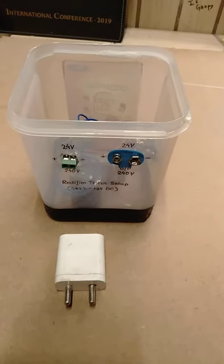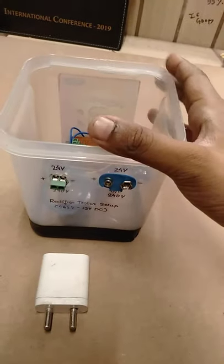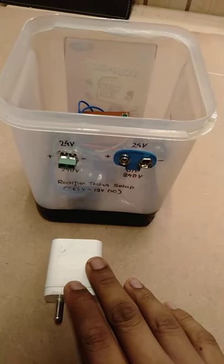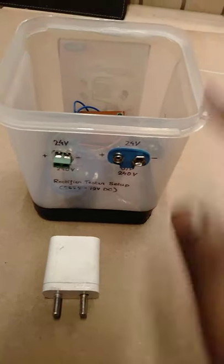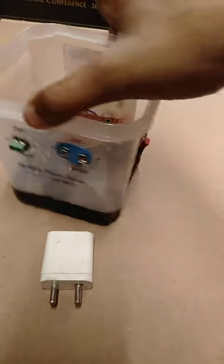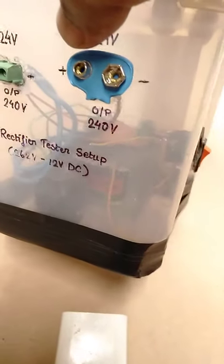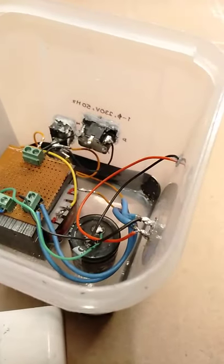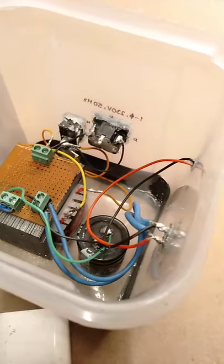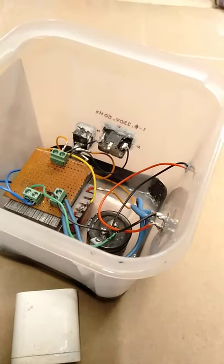There are also frequency considerations and the efficiency model of the system. Although both are power equipment, the SMPS is more efficient than the rectifier. The biggest problem hitting the rectifier's efficiency is the no-load losses caused by the capacitor. Here is the cylindrical electrolytic capacitor between the wires, which is used for filtering purposes — I've intentionally used 330 microfarad for that purpose.